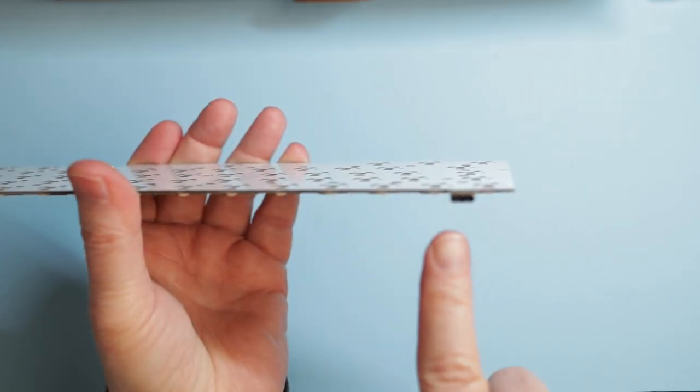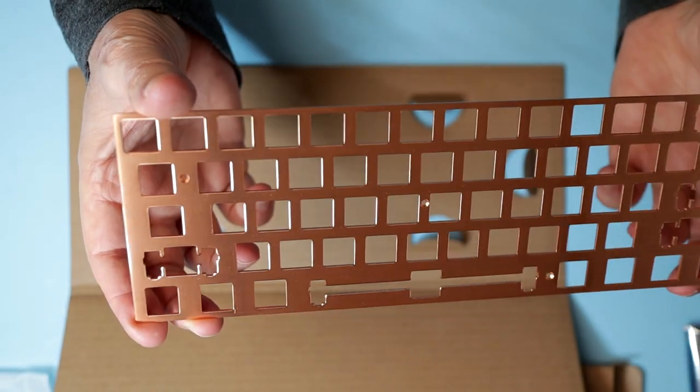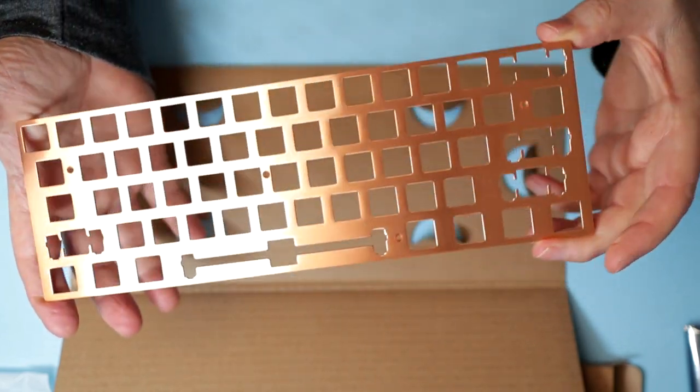While I'm not much of a fan of plastic USB-C cables, the PCB is quite nice, and like I said, has dual USB connections, which I really enjoy. Having the ability to plug into either side of a keyboard is awesome. In a separate box, you will find your plate of choice — ours is the polished copper, and they have done a genuinely nice job with this as well. The first step with this or any keyboard build is to test the PCB. You can go to keyboardtester.com, and a set of tweezers will do the job nicely.